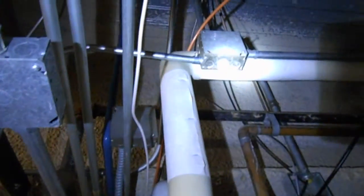Okay, there we go, all done. We got our EMT up there packed in the box with a pretty little knockout cover in the old hole, and we're going to ride on down nice and straight into our disconnect.